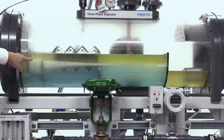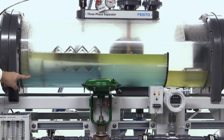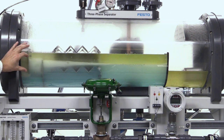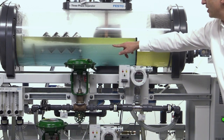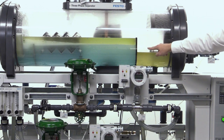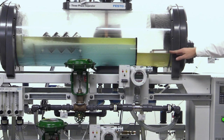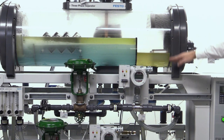The inlet zone is where the emulsion is created. The deflection plate is the first step in the separation process — the emulsion goes down and flows under the plate, then passes through the coalescing plates. The emulsion layer is quite thick at the beginning of the process and its thickness decreases as it progresses. Components of the emulsion are eventually completely separated due to gravity.